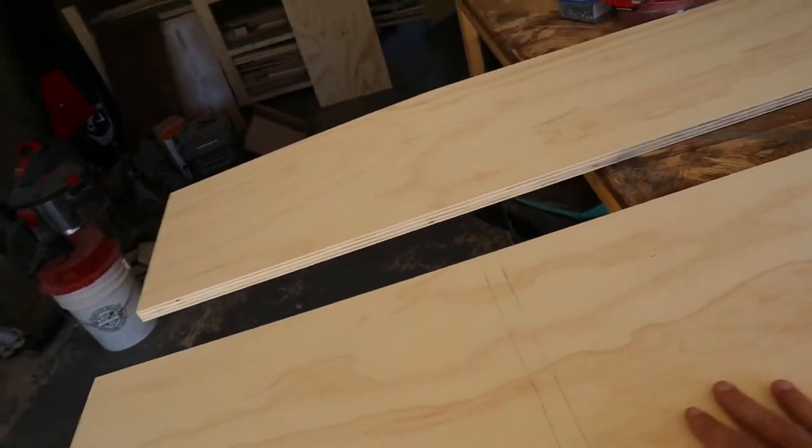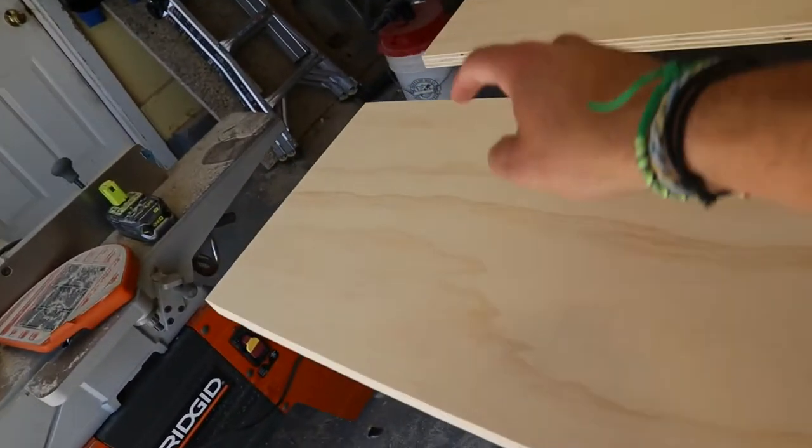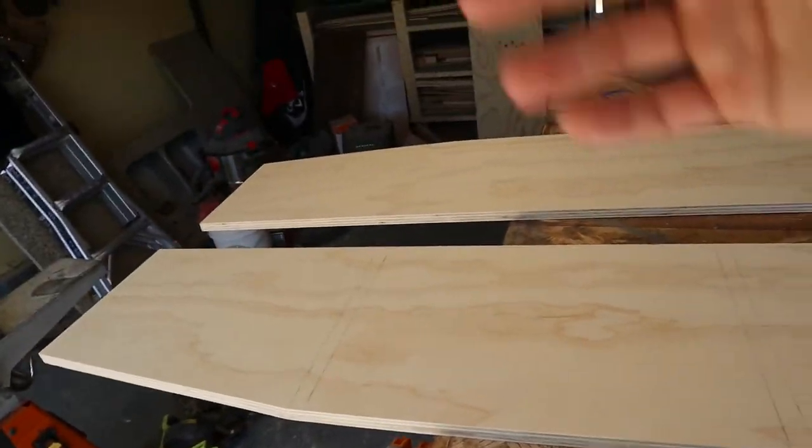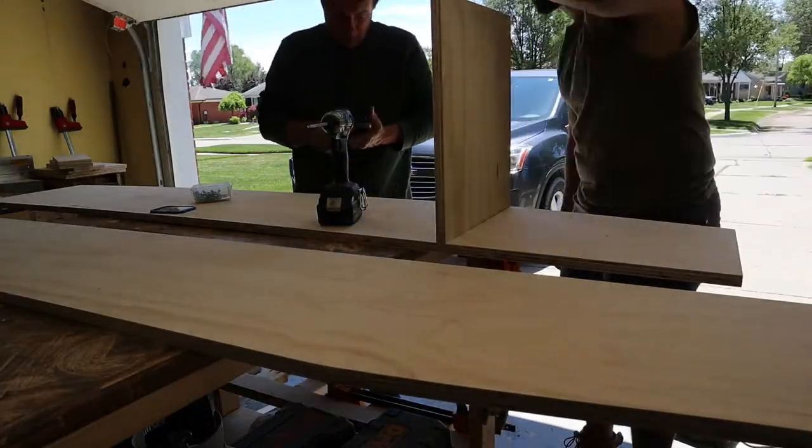While I was off camera, I sanded everything with 220 grit for the interior pieces as well as the shelves. Now I'm going to pre-drill a couple holes at the bottom and top so that when this interior piece mounts into the wall of our closet, it'll be nice and secure with drywall anchors — easier to do while it's disassembled versus trying to finagle your way around a tight space. For whatever reason, our pocket hole screws are just blasting out through the side of our shelf. So to make up for that, I'm going to use wood glue and brad nails to assemble this.